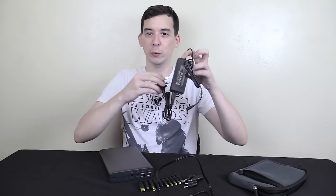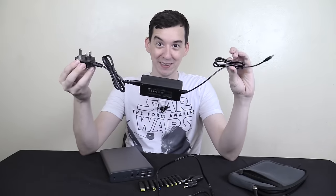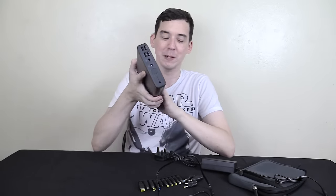Now let's get to another thing that's included: the charger. Look at this thing — it's a beast. Imagine if you had to recharge 50,000 milliamp hour using a micro USB cable like traditional power banks — it would take forever. So I'm happy they included this custom charger. It outputs 16.8 volts up to 2.5 amps, which is somewhere around a maximum of 42 watts. This thing is a beast and let me plug it in and show you.